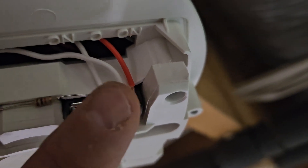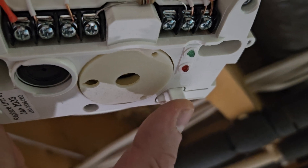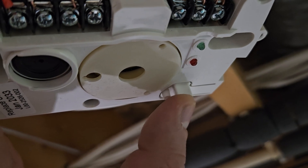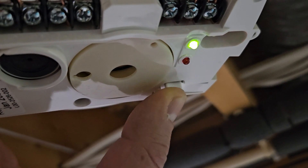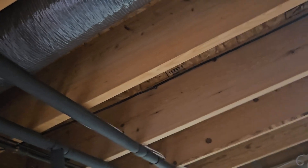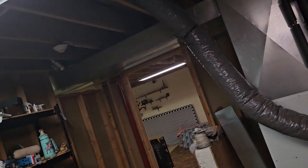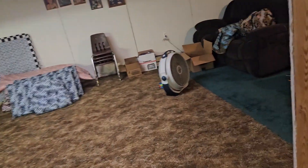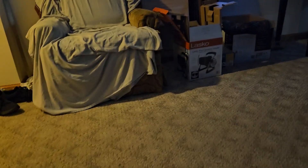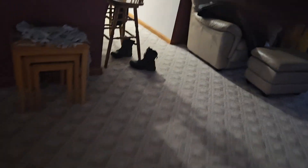Don't put your resistor where the zones are. This is how you would test it using the test button — you just hold that down. See, then it beeps and now it's in alarm. I know it sounds awfully quiet.